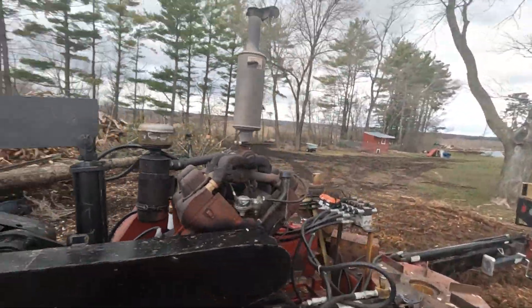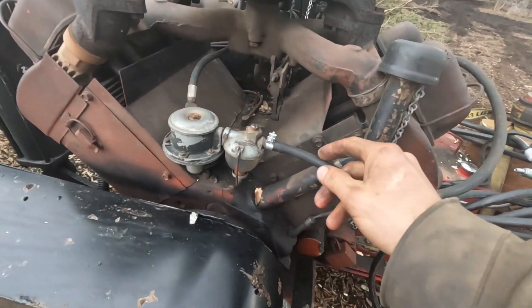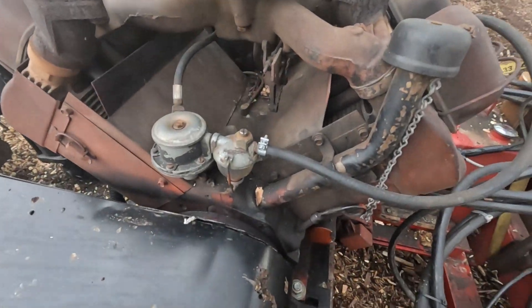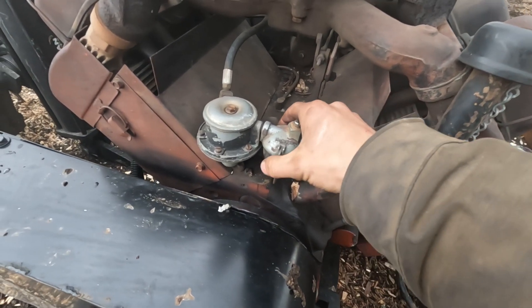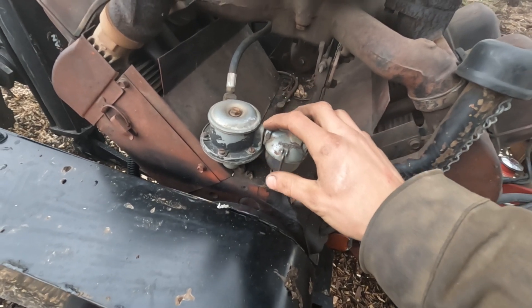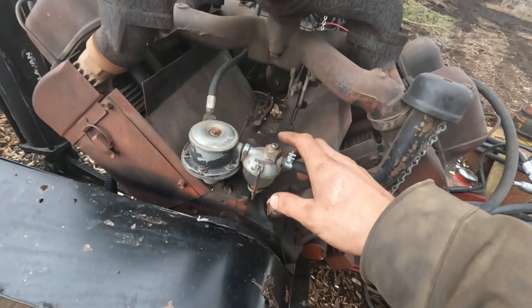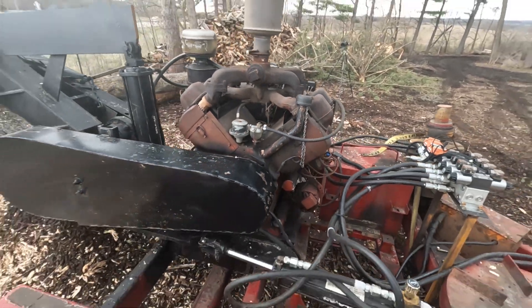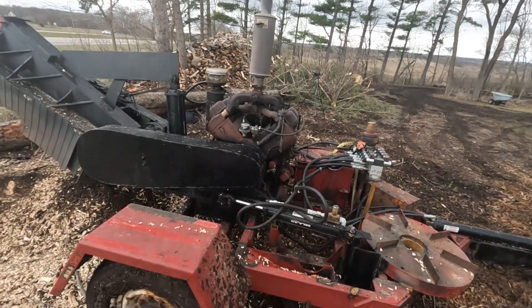I had a little problem with my connections here. Sorry about the road noise — I'm right by the highway. I thought my problem was this hose where it needed hose clamps, but then this fuel bowl moved really easily on that pipe thread — that's a little chase right there. So I tightened up that chase three full turns and it works a lot better under load. This machine's been outside so it caught a little wind, a little rain, some vibration.